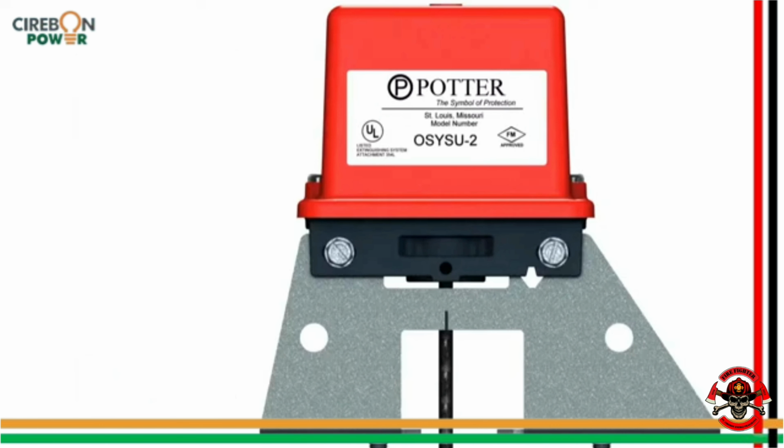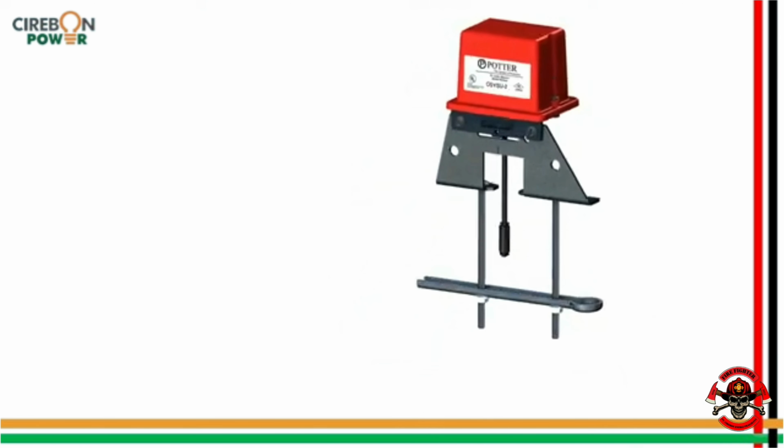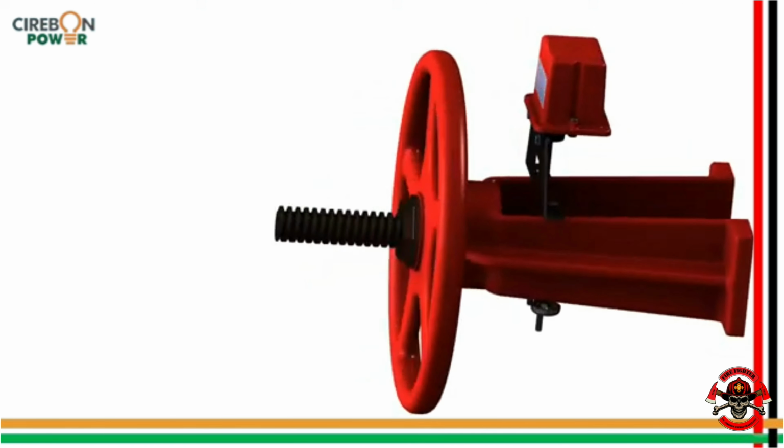The new Potter OSYSU supervisory switch is used to monitor the position of an OS&Y type valve. It is a three-position switch with the center position being normal. Normal is when the switch is installed on the valve, the valve is fully open, and the trip lever of the switch is sitting down in the groove of the valve stem.